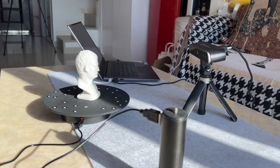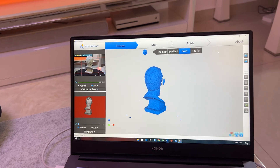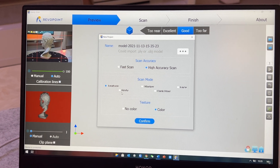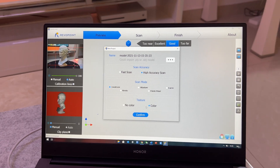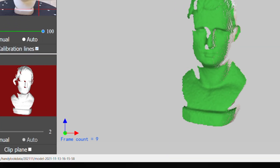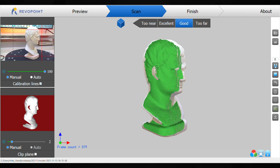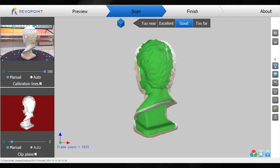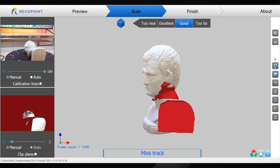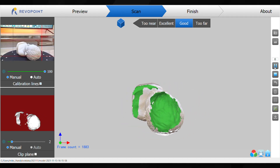To make the scan even more accurate, the Pop 2 has a rotating stand covered in mapping points, so you don't even have to move the scanner while it's in motion. Before you scan, you can choose a specific scanning mode like faces, features, body, dark hair, and more, as well as color or black and white scans. I've chosen feature mode in full color at the highest quality, and we're going to scan this miniature statue placed on the stand. As we begin scanning, the system quickly obtains high precision 3D point cloud data at 10 frames per second, with the highest single frame accuracy being 0.1 millimeters, which is incredible. As we finish the scan, we can actually change the position of the object to gain more data from another angle, and the software will automatically recognize the change and adjust, placing the previous scan position over the new position like magic.